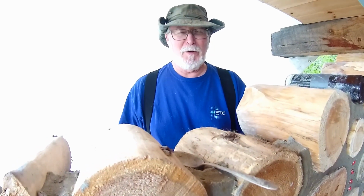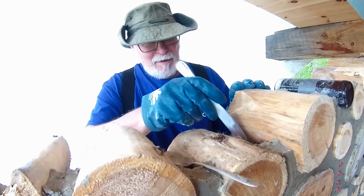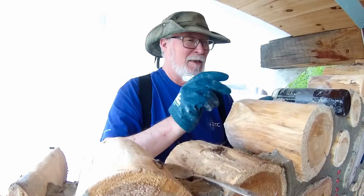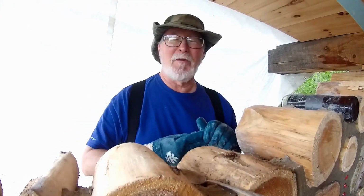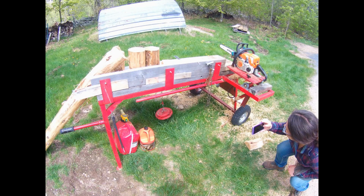Today we're learning on only 8-inch thick walls, which is great for outbuildings, but for an actual house, for insulation, you're probably wanting to go at least 12 inches, or 16 inches rather, and I'll probably do 18 inches in Nova Scotia. And more tricks of the trade.